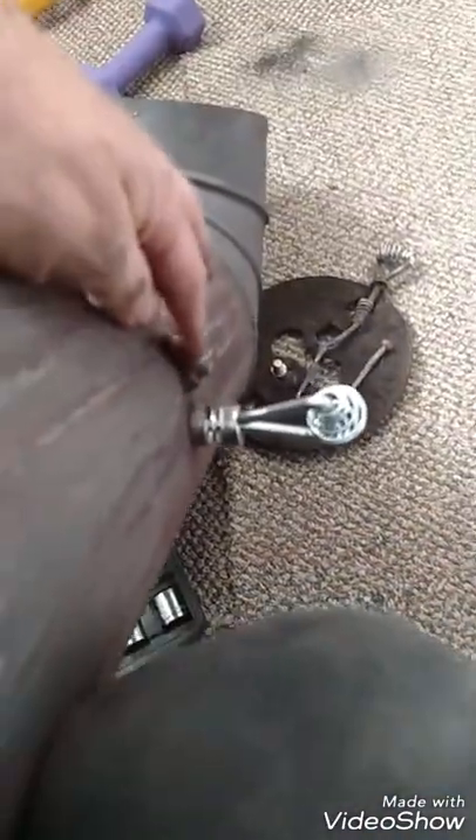Anyways, now it's in there. Now it spins fine — open, close, open, close. On the actual chimney there's a screw so that it doesn't spin all the way. I don't know who put that in or why. You can see it there on the outside. That's how you put your damper in. It should swivel back and forth fairly easy. Then put it back into your chimney and try to line up all the screws. While you're in there, see all the stuff at the bottom — go ahead and clean it out if you want, so you don't have to do it later. And that's how you do that.